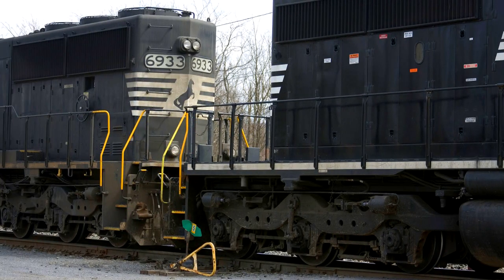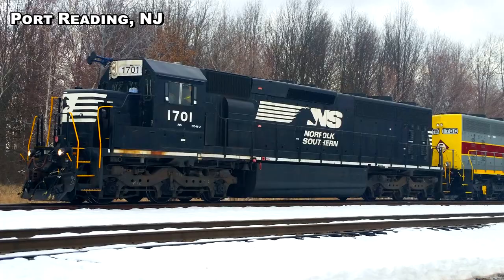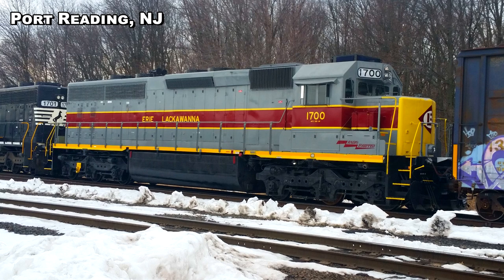On all 6-axle Dash 2 units, the front section of the hood, housing the inertial air intakes and blower duct, was lengthened by roughly 8 inches. On the SD38-2 and SD40-2, this added length was not enough to compensate for the increased frame length, and the result was a significantly larger platform at either end, with the rearmost wheel entirely out from under the end of the hood. On the SD45-2, however, the rear of the hood was also lengthened to fill up the extra frame length, and the added space was used to house longer, narrower radiators that did not require the canted intakes used on the SD45. The longer radiators resulted in 3 very widely spaced rooftop radiator fans.